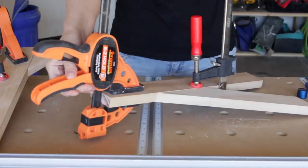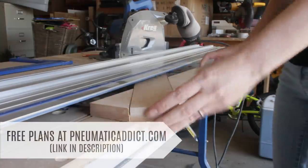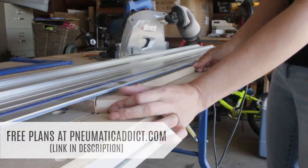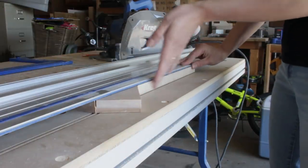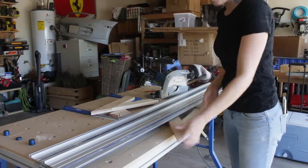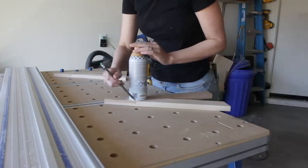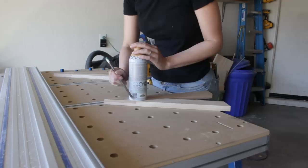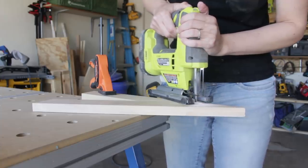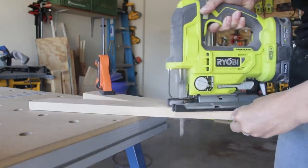At this point my legs were shaped more like X's, and I wanted to cut off the little ears that stuck over the top. I'm sharing free building plans for this project on my website — check the link in the description. I aligned the long side of the legs with the ACS cutting track and cut off the little angled pieces on top. Now I had two upside-down V-shaped legs with very sharp points at the top. I pulled out a can of spray paint and traced a radius to remove that sharp point, then clamped the legs to the ACS work surface and used my jigsaw to trace along the line. The cut was a little tight and I ended up with some burning on the wood, but nothing I couldn't sand off later.